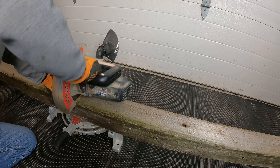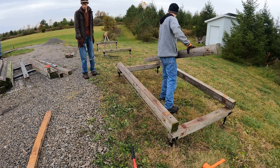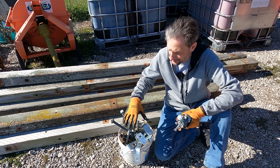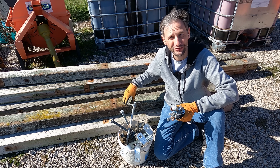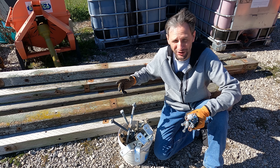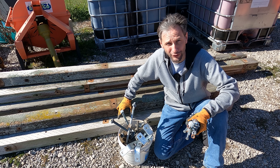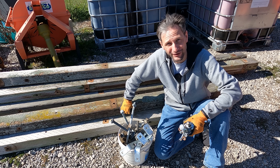Because of my strategic layout, I only had to cut two beams in half for the bottom cords and angle-cut the four braces — basically zero waste for my beams. To minimize the cost of assembly, I'm going to use nuts and bolts and brackets, lag bolts, and things I've salvaged from the power poles and other pallets and projects that I've disassembled over the years. My goal is to not spend any money on hardware on this project. I'm sure inevitably I'll have to buy a screw or nut or bolt somewhere, but I think I can get pretty close.